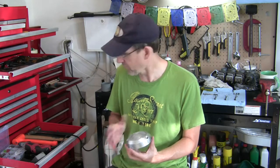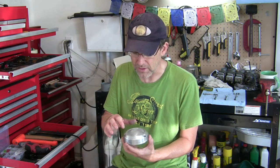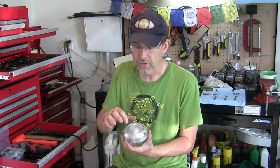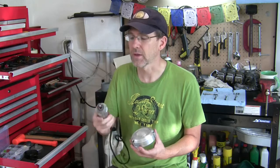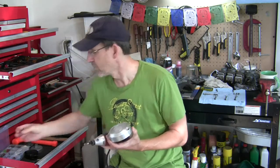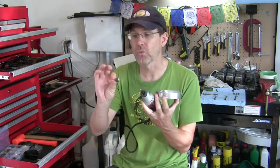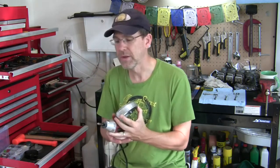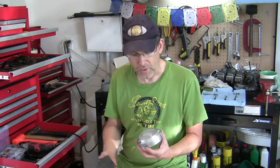I'm cleaning this up first by sanding by hand with a spongy block that I'm guessing is 250-300 grit — cheap Harbor Freight stuff. And then to get into the little nooks and crannies and work into some of the little divots, I'm using my rotary tool, a Dremel-like thing. We've got two different size sanding cylinder drums, and just working in here with that, sanding away.